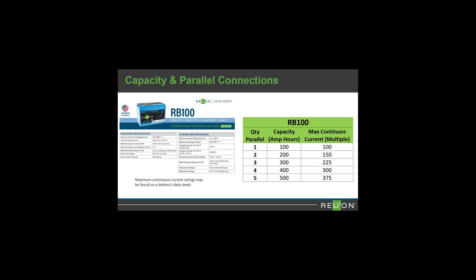Regardless of what battery you buy, you need to be able to recharge them. If your recharging power source, be it a charger or solar panels, cannot meet your daily demands, you need to reduce your loads or augment your recharging power. Otherwise, your battery bank will not get fully charged and you will reduce the available capacity for the subsequent discharge.